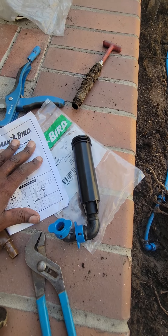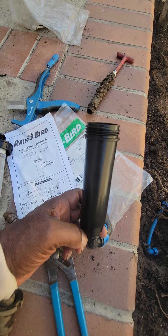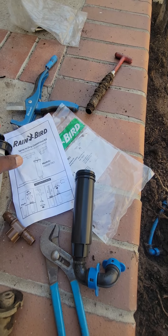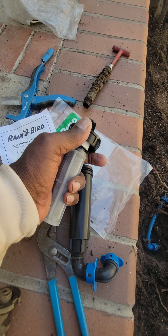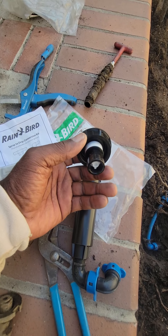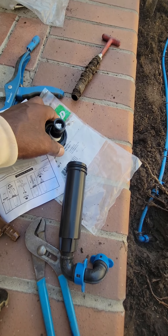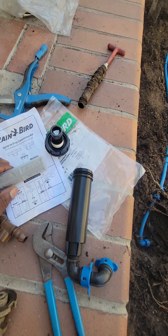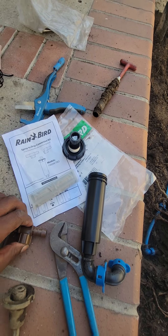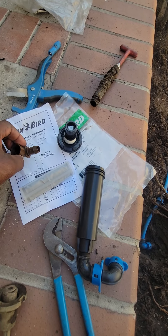To give you a quick overview of what's all involved: we have our Rainbird body — it's a 4-inch Rainbird pop-up body. Inside that body, you have a pressure regulator right here. This pressure regulator regulates the pressure down so that you can utilize the drip irrigation without blowing the pipe off of the hookups, nipples, and apparatus set up for the irrigation system.